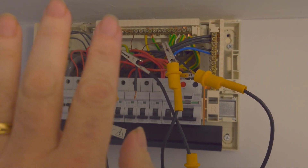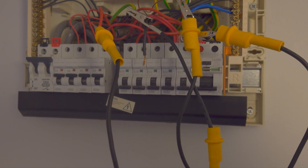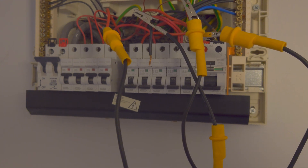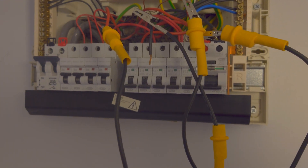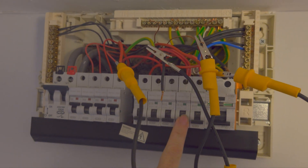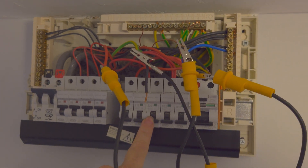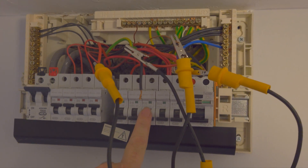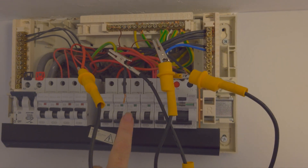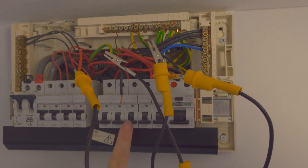On Saturday we found one socket with a damaged neutral, and the socket front was shorting on the back plate - sorted both of those out. This one then wasn't causing any more problems. The right side of the house was fine; this one did occasionally go off on Saturday but I believe that was to do with the foot traffic going on over here. This one then went off on Wednesday early Wednesday morning and we've not been able to get it on since.